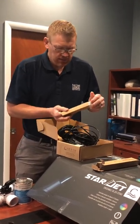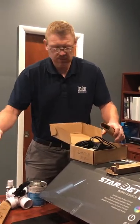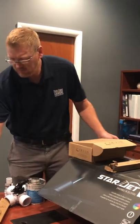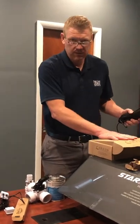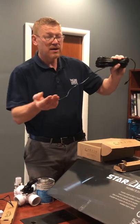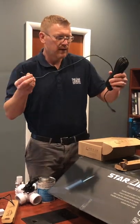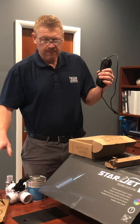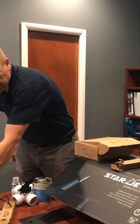At the end — or if you only use two — you need one of these transformer power systems, which has a cord and comes with a remote. We typically sell a kit with two lights and a power cord. One thing to factor in: the cord only goes about six feet, so if you want lights on the opposite end of the pool from the power cord, you'll need to buy a 50-foot extension. You connect the first light to the extension, and there's a clamp under each top rail to hide the wire, then connect the other end to the power cord.